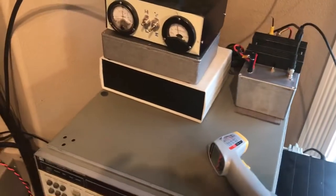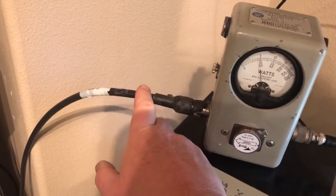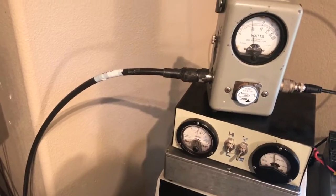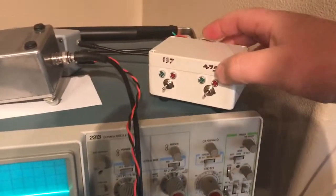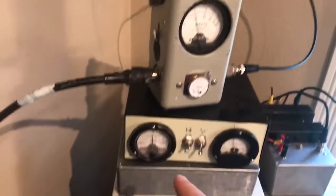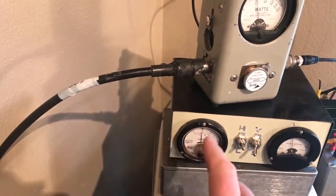So this is the station. The output is using about 280 feet of LMR 400, and that goes to a Marconi with a variometer and top loading — about 200 feet of top loading. We can tune the variometer from here by moving this toggle switch either one way or the other, which drives the motor down at the antenna base. We can actually see the relative resonance changing, so we tweak this to get the phase exactly on the nose. That will vary depending if the wind is blowing around.